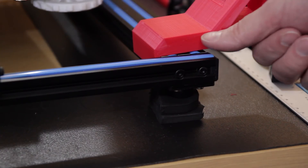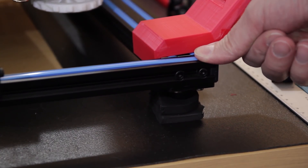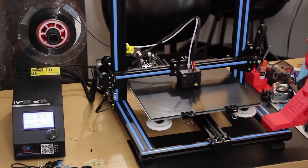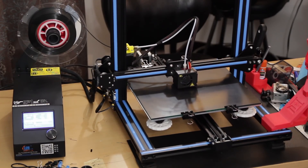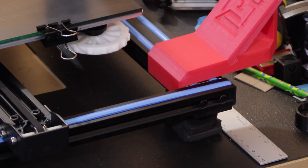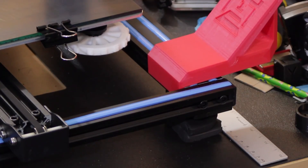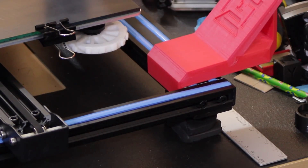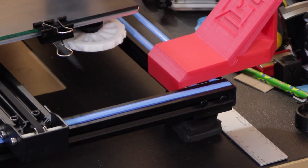The whole idea is that this will act as a shock absorber as your print head or build surface is moving back and forth. Instead of that harsh motion being transferred through the frame and back into your print, it goes down into the feet and is transferred into more of the table if anything is shaking. So that is going to help take some of that vibration out of your print.